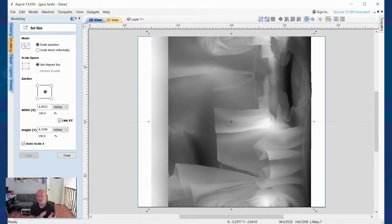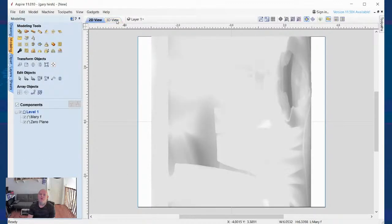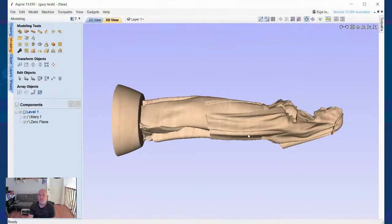That gets us pretty darn close to what we need, and we can go from there. All right. So as you can see, neither one of these are merged planes. They're individuals. And this is what we have right now. If we started cutting, doing the roughing pass and the finish pass, our tool is going to come up here, down. It's going to go all the way to the center. It's going to clear this and go all the way down to the center.